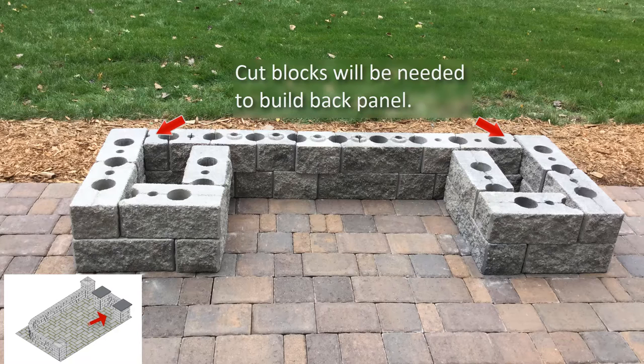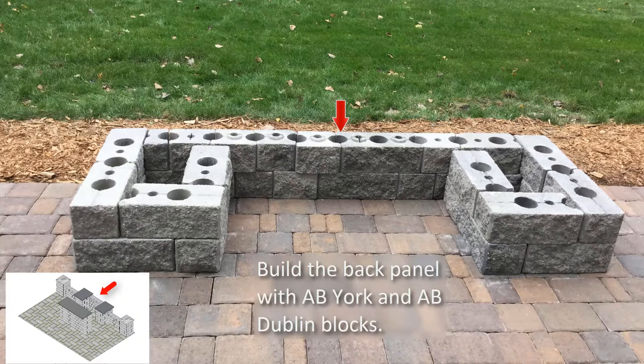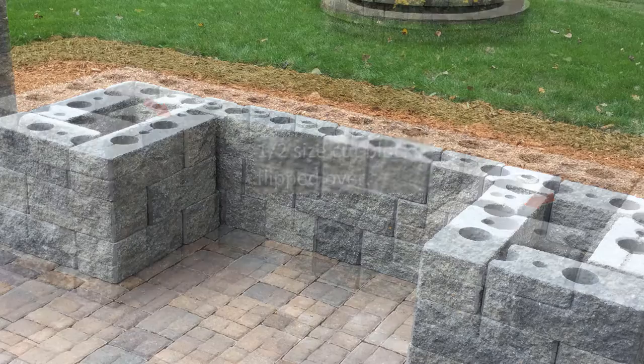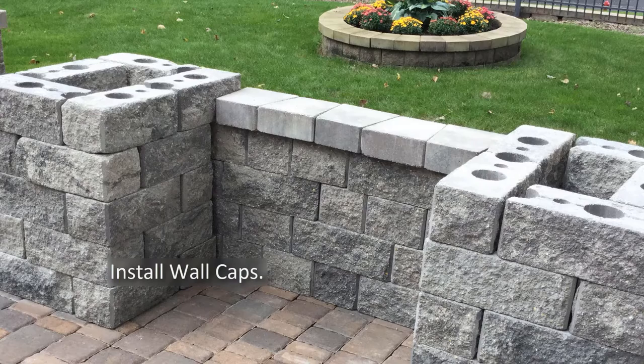To start and finish the second course of the back wall panel, we will need to use cut blocks. These cut blocks will be used on every course of the wall panels when meeting up with the side of the corner block. For this course, use the pre-marked blocks and cut down the center of the raised ring to create the three-quarter and one-quarter size. Install the two cut blocks on either side of the wall panel with the cut side against the corner blocks, then install AB York and AB Dublin blocks between to complete the second course. Install additional courses following the same patterns as the first and second courses. A few blocks will need to be flipped upside down in place of removing the raised rings, as was done on the first course. On the top course, install five AB corner blocks on the post with the long sides facing out. Install wall caps on the back wall. You can choose to secure them in place with masonry adhesive.